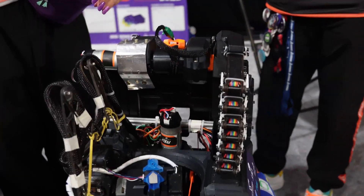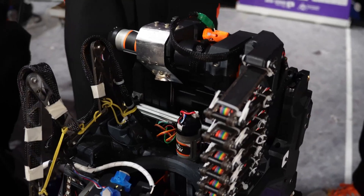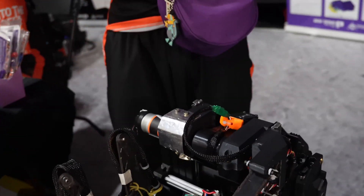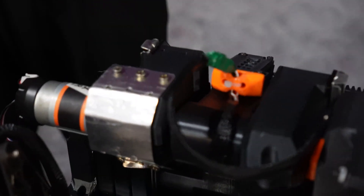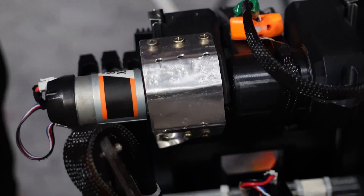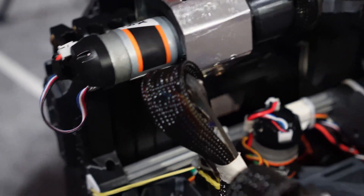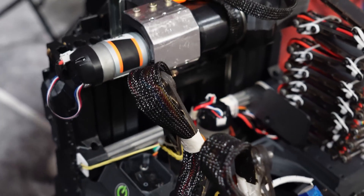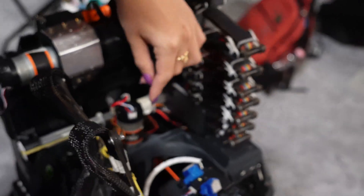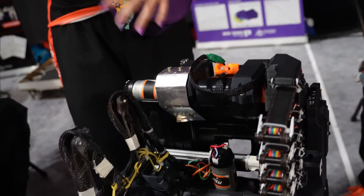Something really fun is that it's also happening while the robot is moving. The driver can position the robot in the correct position for the basket and the system can run at the same time. We also have encoders and motors controlling the slide systems, and limit switches used as safety measures so nothing breaks.